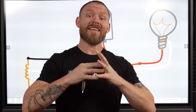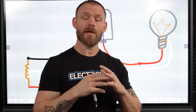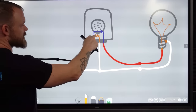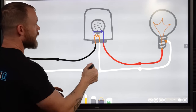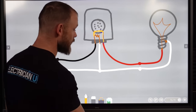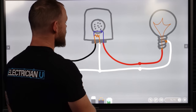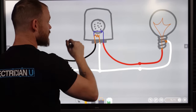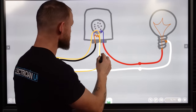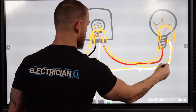Once we hook this thing up, it's going to be energized and it's going to open things up. As the photons are coming in, it's staying open, and when the photons go away it goes back to its normally closed state — like you just bought it off the shelf. It's not really a coil; it's a variable resistor. Energizing it keeps it open so current can't flow through the switch, then once there's no more photons, it closes back. Current flows, the completed circuit connects the black side to the red side.